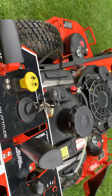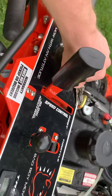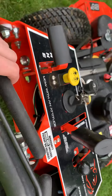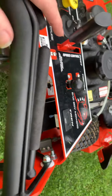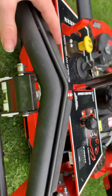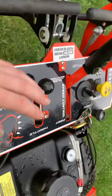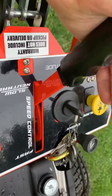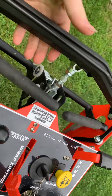But if this is electric start, you're going to have to hold it all the way over to here and you'll have your starter position. As for the drive: this is to steer left, this is to steer right. You want to have this bail down because what this bail does is it's a safety acknowledging that you're there. A lot of people get wrong that they always adjust their throttle to adjust their speed — you do not need to do that. This is what the speed control is for.